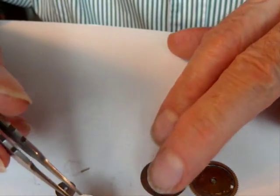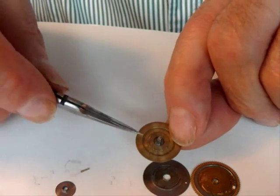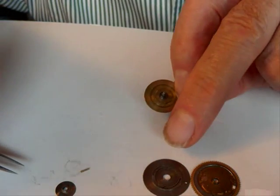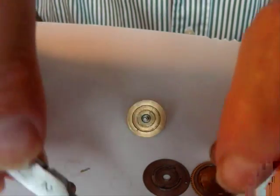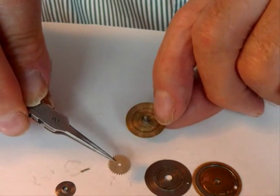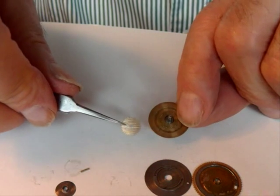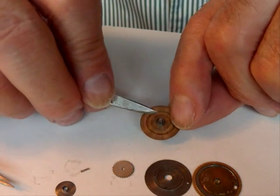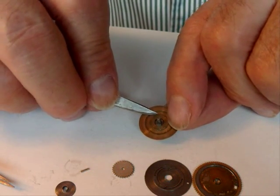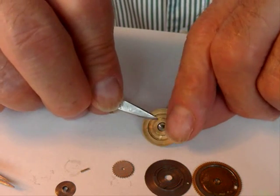One of them has been damaged because someone did turn this fusee backwards and in doing so they stripped the teeth. If you do need to replace the ratchet wheel, that's made of brass, and the replacement in this case has much coarser teeth than the original, which will help because it will be much stronger and much less liable to be damaged by someone forcing it backwards.